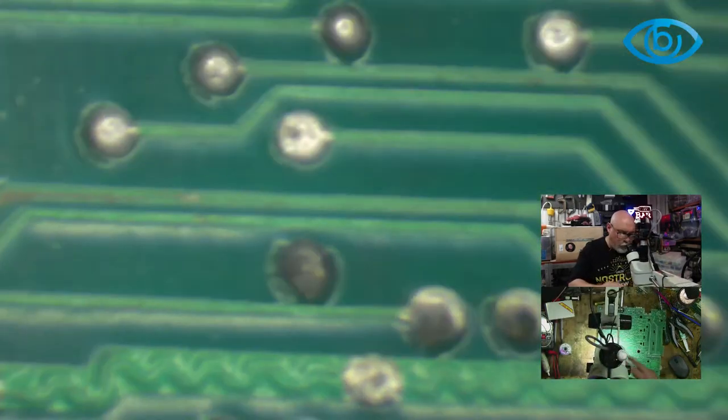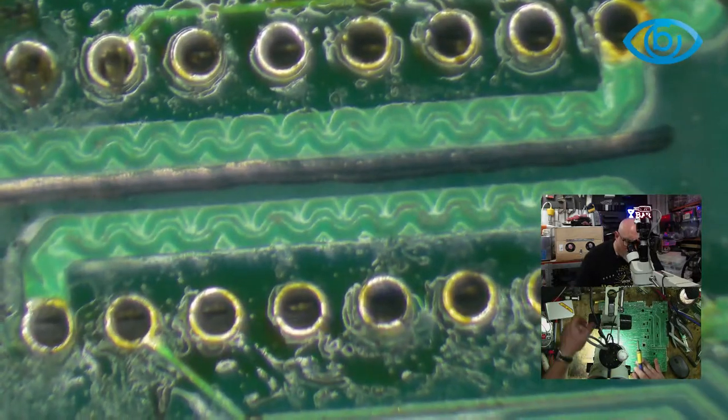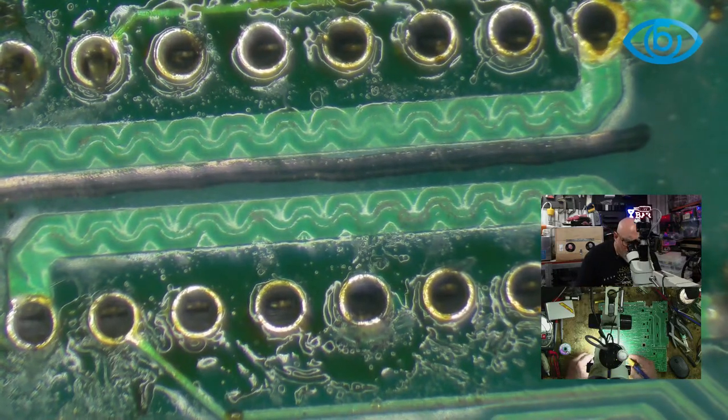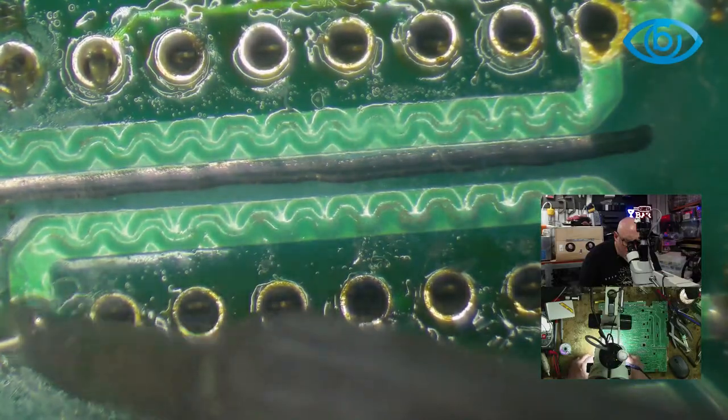Okay. One socket. Now, this is the little trick that I saw. It's a nice little soldery type trick, and this is one that I was watching Joe do the other day as well. It is where you bend a couple of pins, just two pins, just two pins to hold the thingy in place, but you don't solder the bent pins, you solder unbent pins. And then you unbend the bent pins before you solder them. That way you solder the thing on without any bent pins. So, here's one.